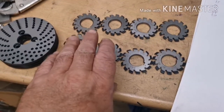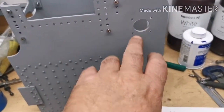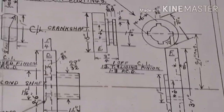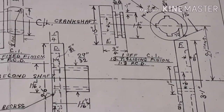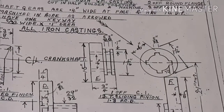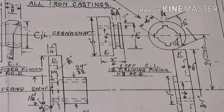While waiting for some castings for the horn plates, I've decided I'm going to try and do a gear on the drawing. Assuming it's right, there is a 13-tooth gear, and all the gears on there are going to be 10 diametral pitch — that means 10 teeth to the inch.